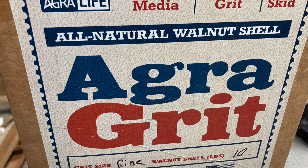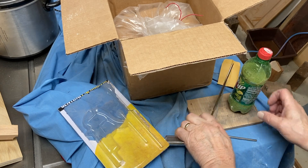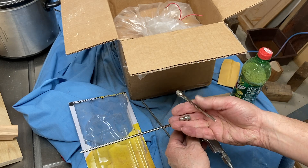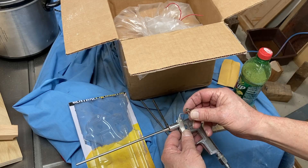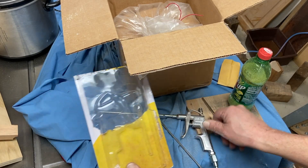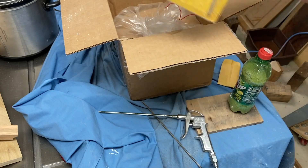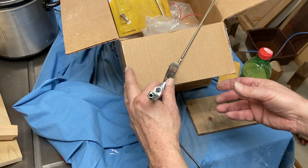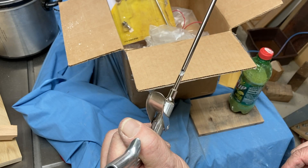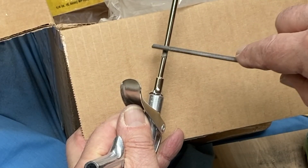It does no damage to the metal and it's also not quite as dangerous to breathe as silica sand. Here's the little set you get from Harbor Freight — it comes with three different nozzle lengths. I used the longest length; it just seemed like the thing to do, and the one I'd seen on YouTube did a similar thing. What I did is I took the nozzle — that long tube — and filed a little recess in it using a chainsaw file.